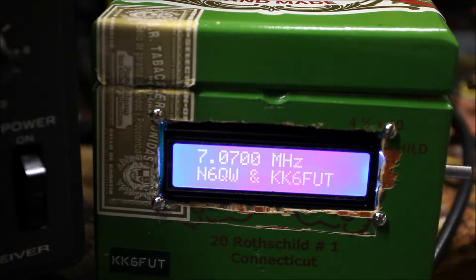This one can actually handle CW and sideband and is kind of the building block for a full sideband radio. The idea is to start out with a simple receiver and eventually turn it into a transceiver. This uses an Arduino and direct digital synthesis DDS chip, which you can get on eBay for just about nothing, and an audio amplifier that uses 2N3904 and 2N3906 — all discrete components.